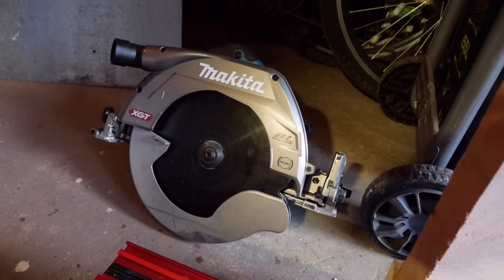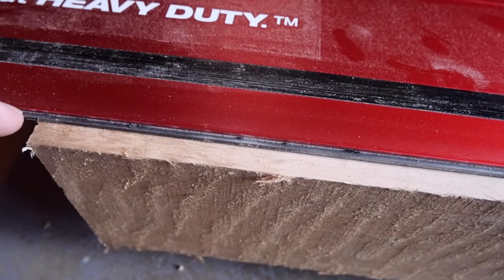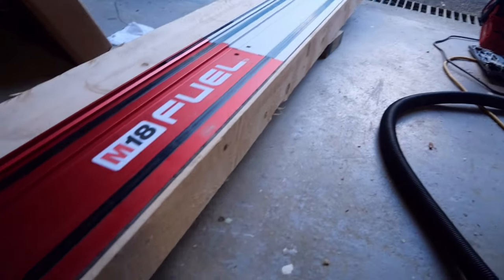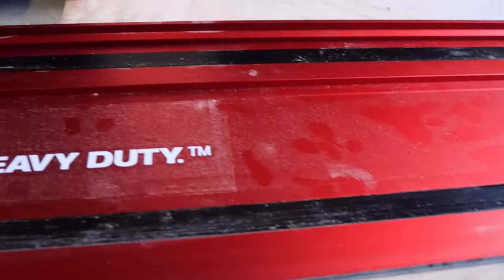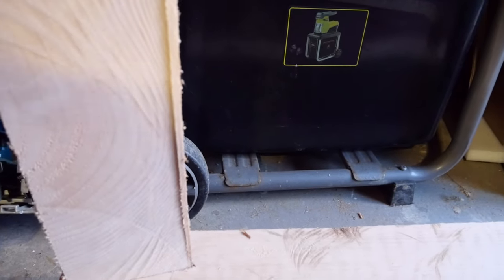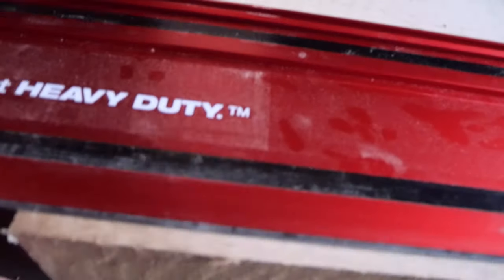Unfortunately this timber is 110 millimeters thick — not even my big Makita 270mm blade saw gets through it in one pass — so I've got to flip it and cut again from the other side. I thought about doing this cut with the large Makita, but it's going to cut the splinter strip and won't work as well with the Milwaukee. I want it to work with the plunge saw more. For reference, the 270mm saw cuts to about 104mm — so close, but not quite.